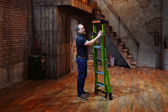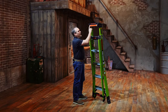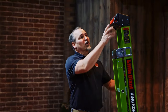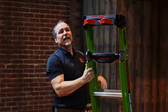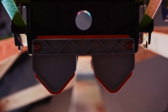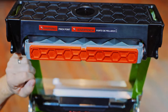The top cap, the hinge, the back legs, and the feet are all designed to be used in this safe position. At the top cap, not every surface that you lean a ladder on is going to be flat. So once we push in these buttons left and right, we can rotate this wall pad around. Now you can safely use the King Combo in inside corners, outside corners, against 2x4 studs, pipes, holes — a variety of situations. Rotate it the same way to put it back in its storage position.